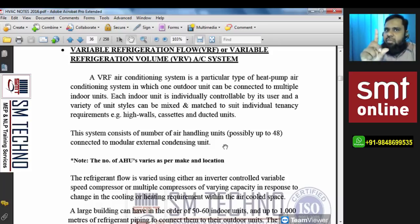In VRF, we have one outdoor and multiple indoors. For example, a 20TR outdoor with one compressor may be connected to multiple indoor FCUs of 2TR each — meaning 10 indoor units can be connected. The most commonly used indoor unit with VRF is the cassette type, because it provides uniform air distribution, looks nice in interiors, and allows fresh air addition. So cassette is the default choice unless the interior demands something different.